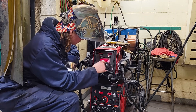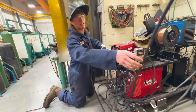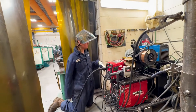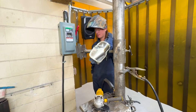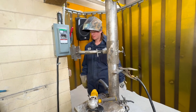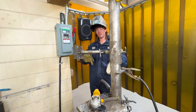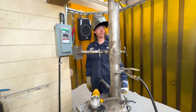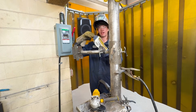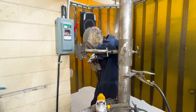Down here you've got your ground — you hook it to your material, your stand which you're going to be welding on — and you've got your whip that runs off whatever side of wire you're running. I'm going to do an uphand weld here on a CWB test coupon. You do learn a lot of uphands: you do your fillet welds and your groove welds. Groove just has a V-groove in it and you try not to blow through. The fillet is just a flat plate — pretty simple, basic, but good to know.